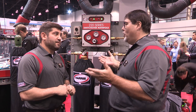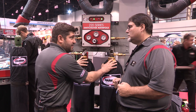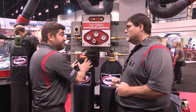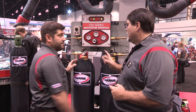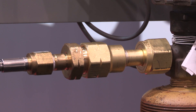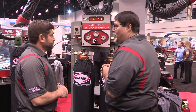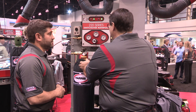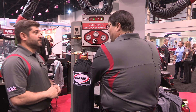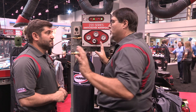It's a win-win for both Lincoln Electric and for our customers as well. Now, can this side be changed safely once it empties and switches over? Absolutely. Because the pigtails — the flexible hoses that attach to these cylinders — have a built-in check valve right here. That check valve prevents any backflow of gas from this side while they're changing out the cylinders. So once the cylinders go empty and it switches over to this side, you can safely change out cylinders even while operating with no issues.